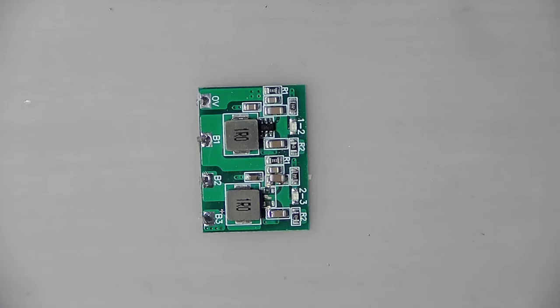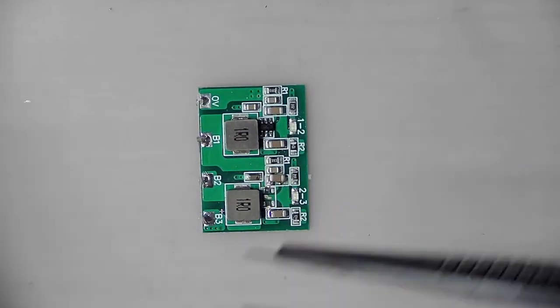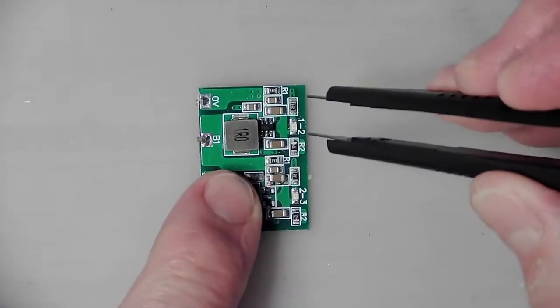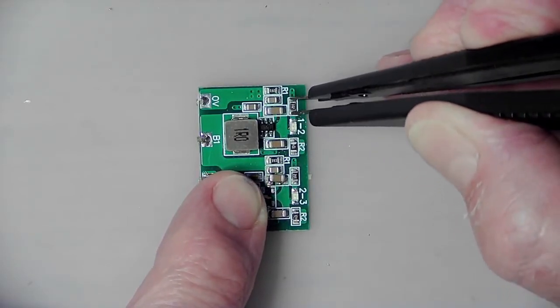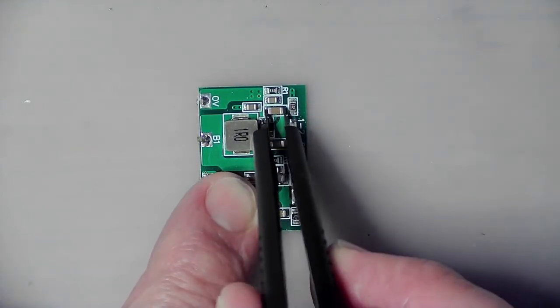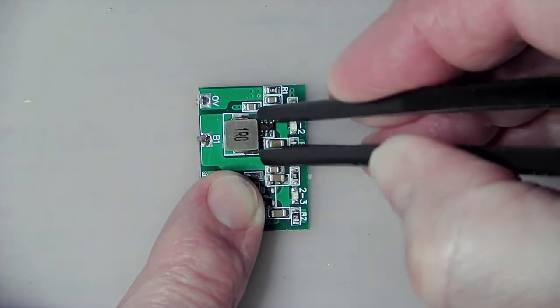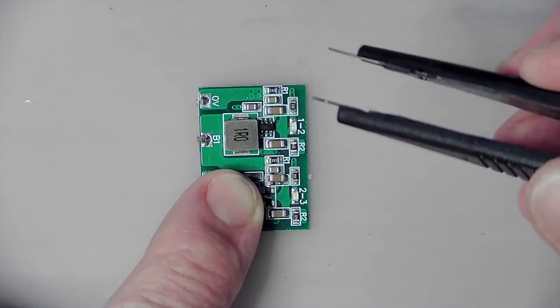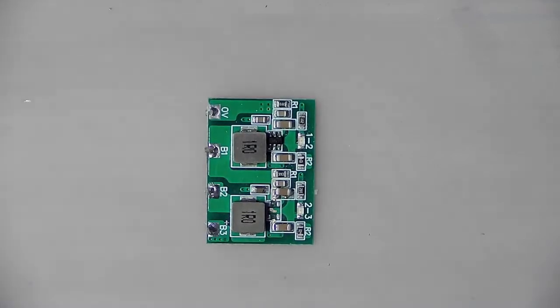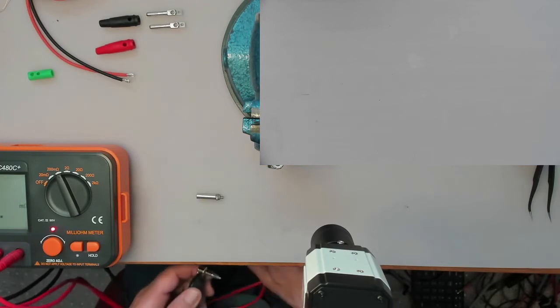Okay, a little insert over here. I forgot to mention these tweezers here. They can also be handy. They can be used on small circuit boards like this to measure SMD components in circuit, like a little resistor or a capacitor like that, and even this inductor over here, and little LEDs and so on. So I do use those occasionally. Okay, so let's talk about Kelvin clips and banana plugs.